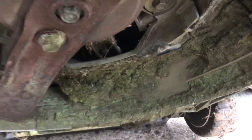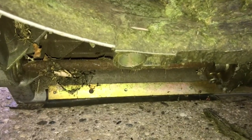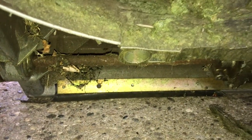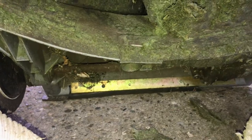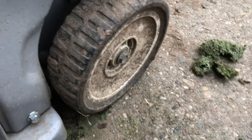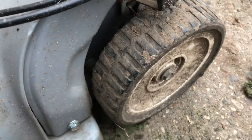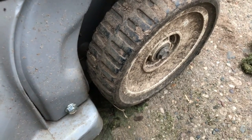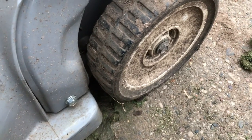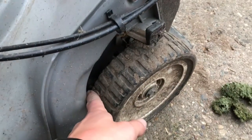I don't know if we can get at the PTO on there or if we'll have to take the blade off. Just to let you guys know, there's a third bolt hanging out back here that you might miss like I did. I found a parts diagram and you've got to take this wheel off to get to a little bolt down inside there — kind of a dumb design in my opinion. I tried punching up from the top but that didn't work, so that's why I found that bolt.